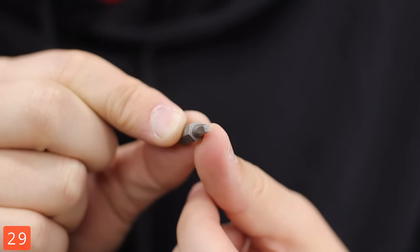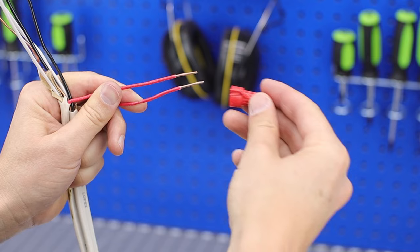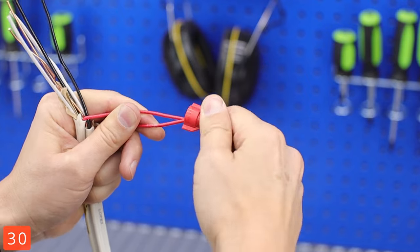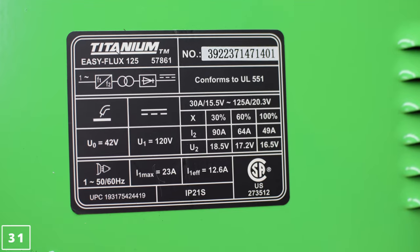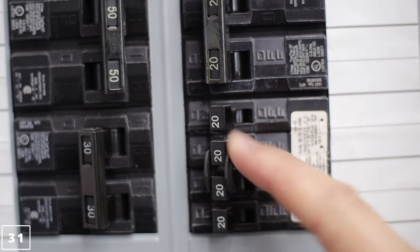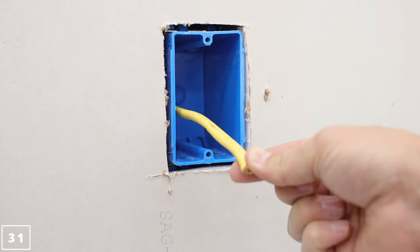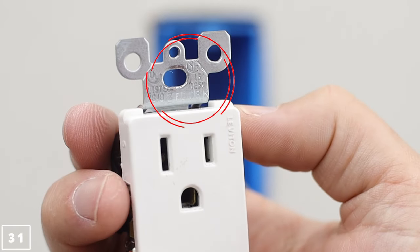If it's newer and has a square screw, use a combination or Robertson square number 1 bit. Do not pre-twist the wires — let your nuts do the work. It's not that a single appliance could pull 20 amps, but multiple put together could. That's why you'll see 20 amp breakers with 12 gauge wire, but only 15 amp receptacles.